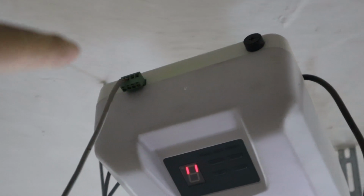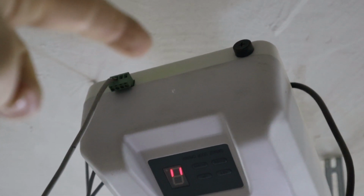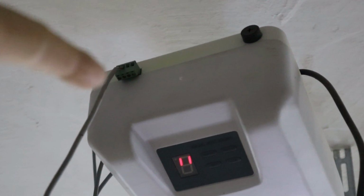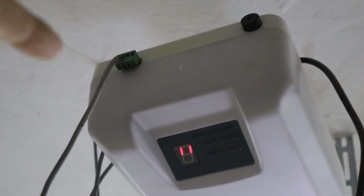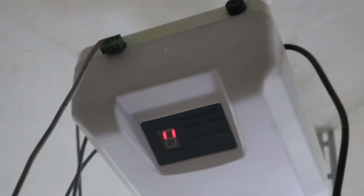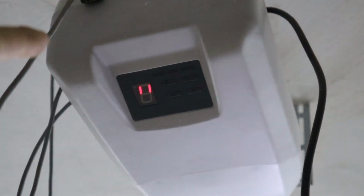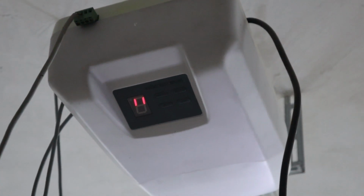That cable from the wall comes here in this plug, so I'm planning to add the controller on top, and then I'll just connect my wires from the relay to basically override the switch, and that's how I plan to have the control enabled without actually modifying any of the garage door functionality as it is now.